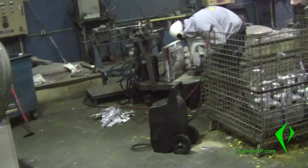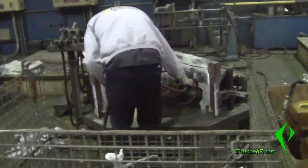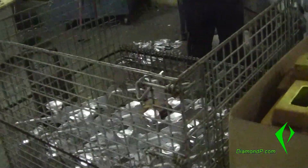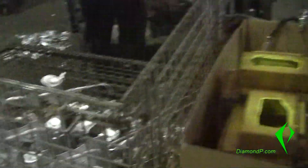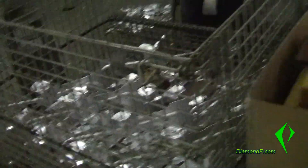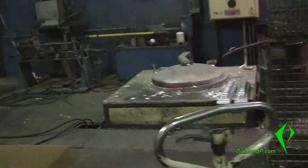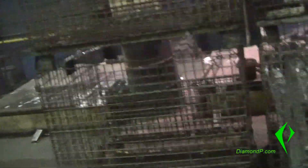Here he's cleaning off some of the insulating coating on the permanent mold. This is actually an iron mold that's poured with aluminum metal, and the cores are placed inside. Then the casting is pulled out. Then you have the 2,000-pound furnaces at 1,400 or 1,300 degrees, depending on the job we're making.